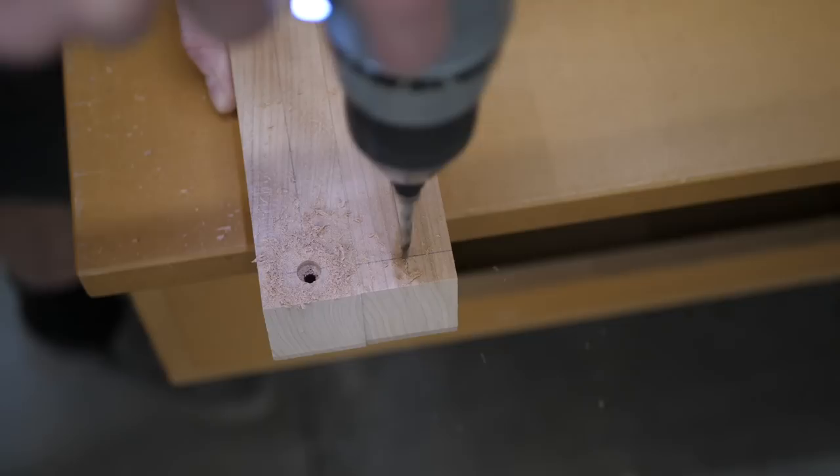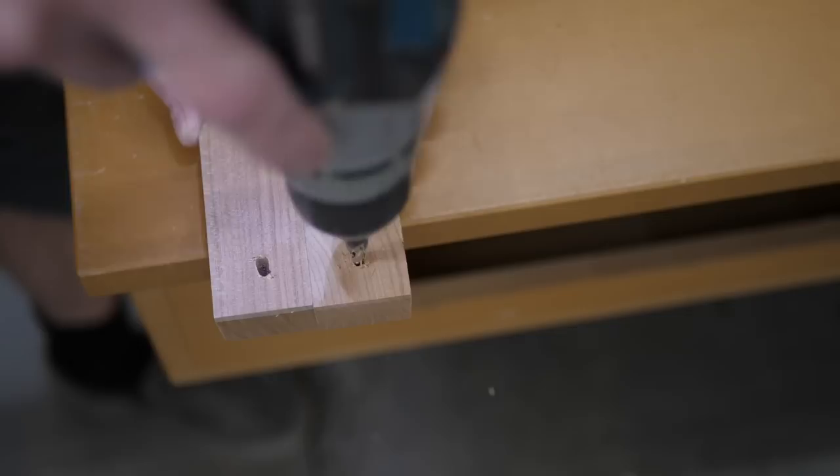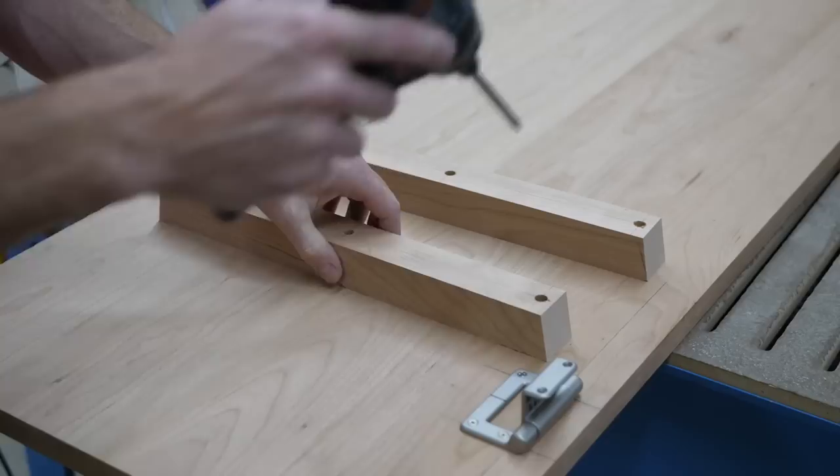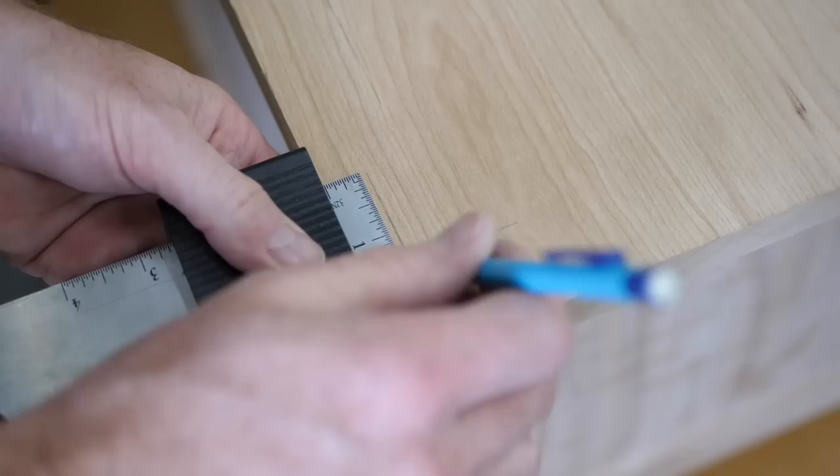People get really wrapped around the axle when it comes to seasonal wood movement — for this width of top I just oval out the screw holes a little, which is plenty of room for movement. The battens were made from extra leg material; I cut and install them with one-eighth inch clearance front and back.